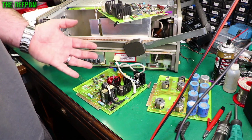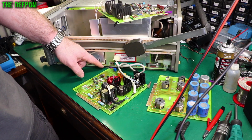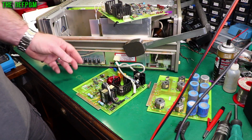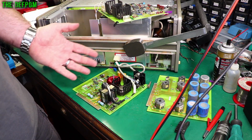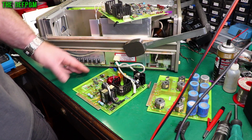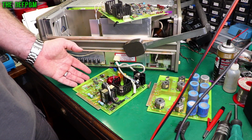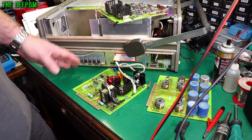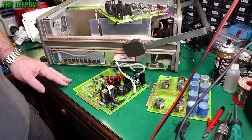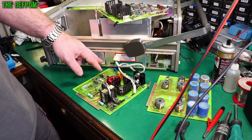One trick I have used in the past, and sometimes it does work, is you can measure the resistance of the device, measure the resistance of something else, measure the resistance of the other thing, and whichever one's got the lowest resistance is obviously where the short is, because that's the hardest short. You know, you're talking milliohm differences. But in this case, the reading is fluctuating very slightly, drifting upwards, so I can't see consistently whether one is lower than the other. Unfortunately I can't do it that way. So I'm going to have to do it by lifting a part out, retesting, and doing a process of elimination that way.